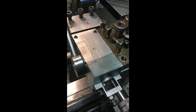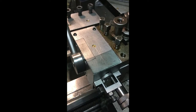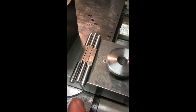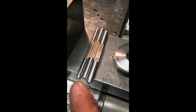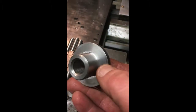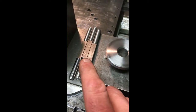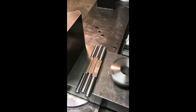I haven't actually used this tool yet, so this prototype is being used for the first time. I've already machined up the blanks. The three you see here are going to be tool post clamps for the holder itself — there'll be five of them, I just did six in case of issues. This is going to be an internal M16 thread on a top hat bush, another is M16x2, and this one is M8x1.25.